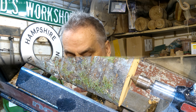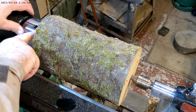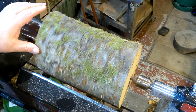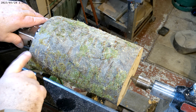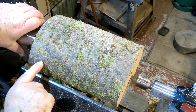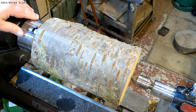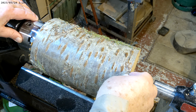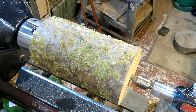So stick with me, see what it will do — I think she would have been pleased with it. I've got my 90mm chuck on this end, got it between centres, and I'm just going to rough it down into a cylindrical shape. There's a bit of swelling on there that will need to come down first, and it's slightly oval. What I want to do is take away all this outer bark and down through the cambium layer — underneath that on the cherry is really soft. So I'll just get my roughing chisel.